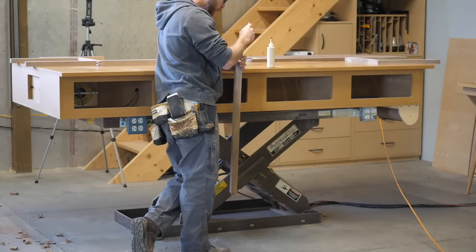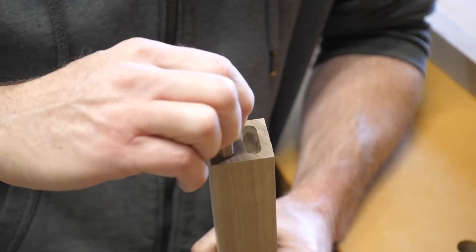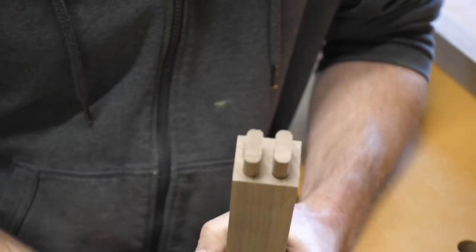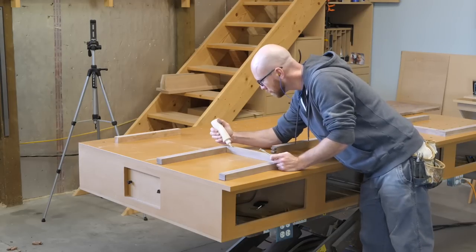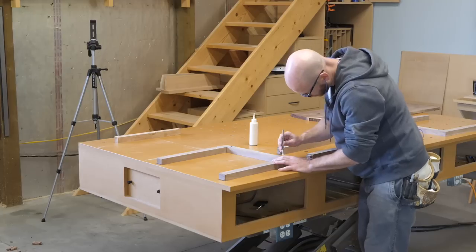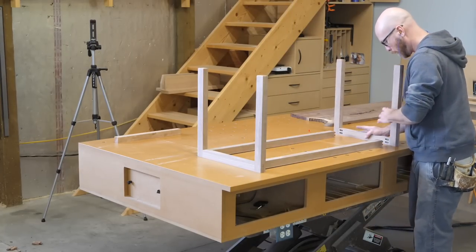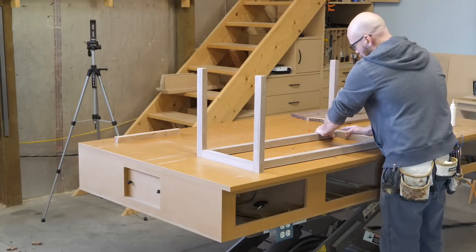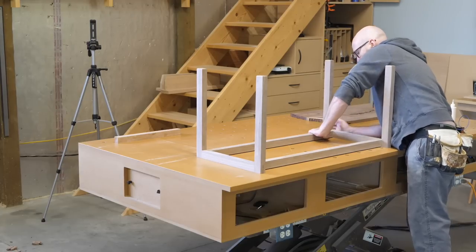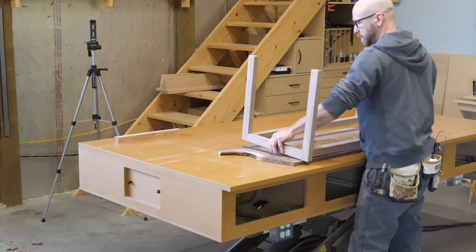Glue-up time. These are called loose tenons — they are mostly as strong as a traditional tenon but in this case easier to cut due to the double tenon setup. Setting up and cutting a traditional double tenon is not an easy task and I don't think it would have been worth the extra effort. I've located the stretchers out towards the edge of the table on purpose — because the top ended up thinner than preferred, the stretcher helps add some visual weight to the top. Nobody likes a wafer-thin top, but an overly thick and blocky top is no good either.